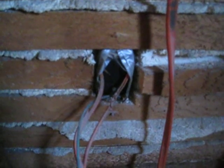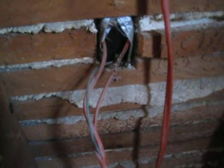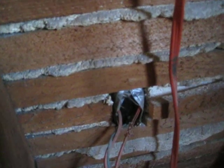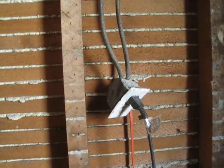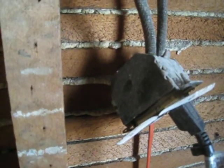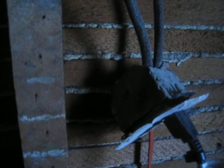So if that very incorrect cable started sparking or got damaged, it's right next to nice wood lath kindling. There should be an enclosure — similar to this one — behind that receptacle.